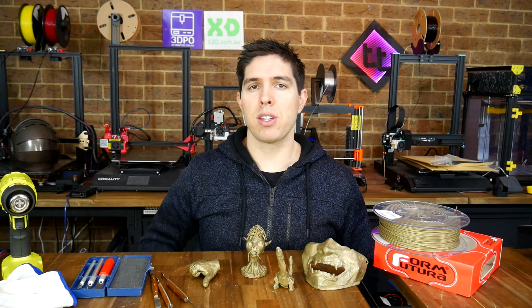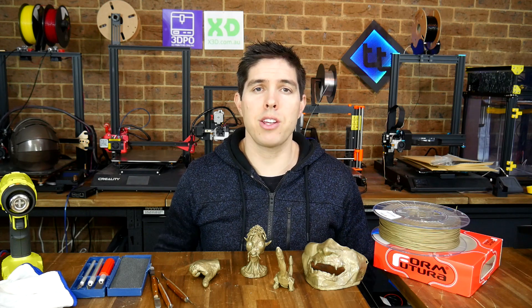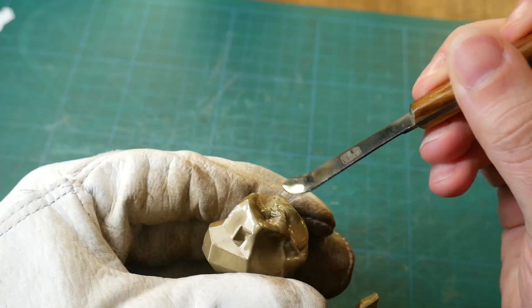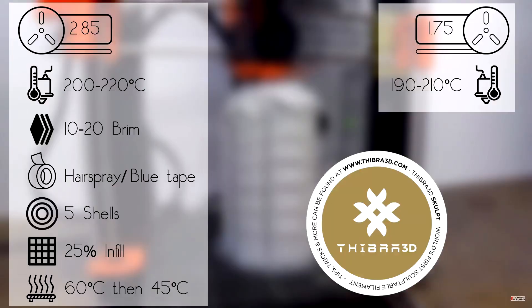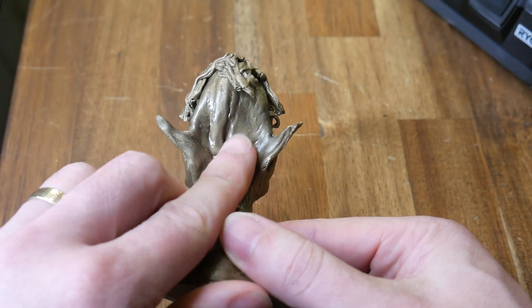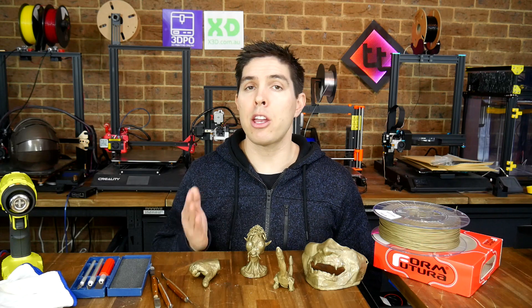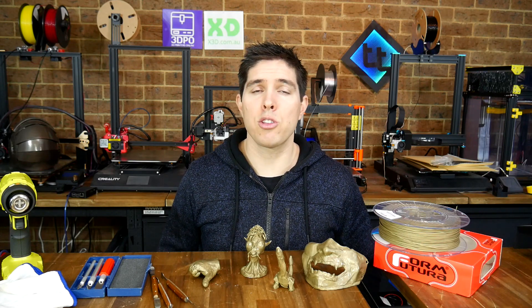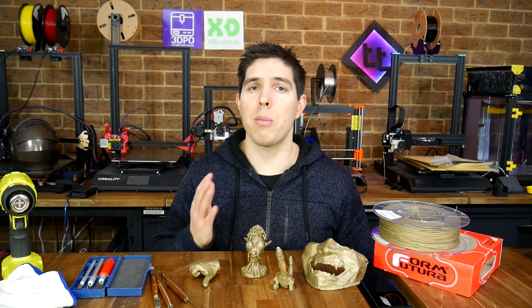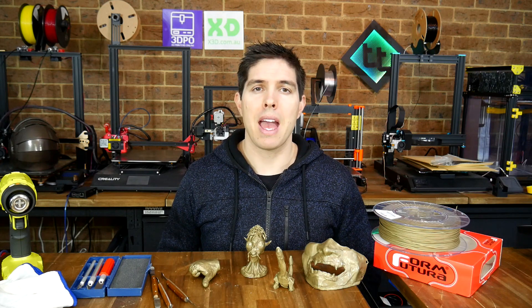So there's my results, and although I think they're interesting, I'll be the first to admit that the limiting factor in this equation was definitely me. I think a lot of my problems would have been avoided if I had printed with thicker walls and a lot higher percentage infill, because that should have stopped the objects from collapsing on themselves when heated up. If you think this would be a useful filament for you to try, please let me know down below in the comments. Also let me know if you were entertained by my epic failures. Thank you so much for watching, and until next time, happy 3D printing.